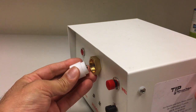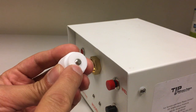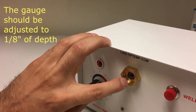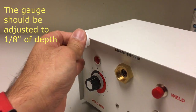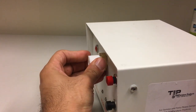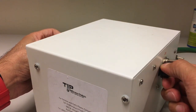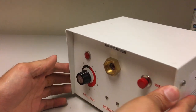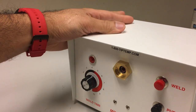We're going to use the depth gauge to push the electrode back inside. This metal piece is going to push the electrode back in. The white plastic area is going to stop at the flange and not go any further. Once you put it in position, turn the machine and screw the holder back — the electrode is now in place. The machine should be ready. All we have to do now is hook it up and perform the welding.